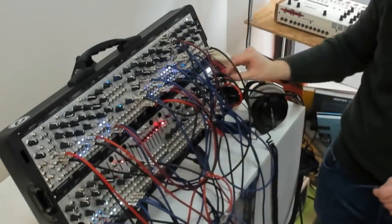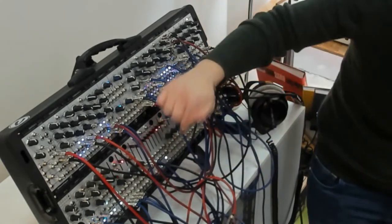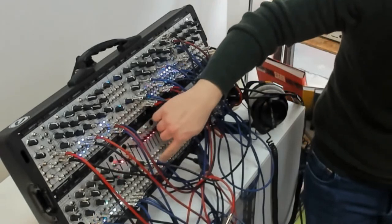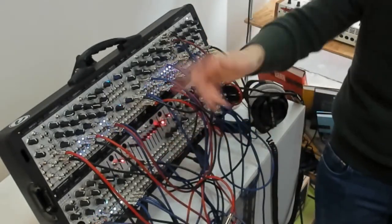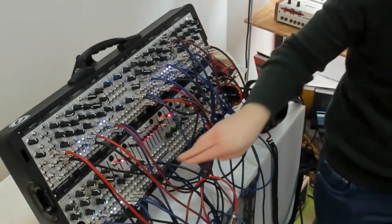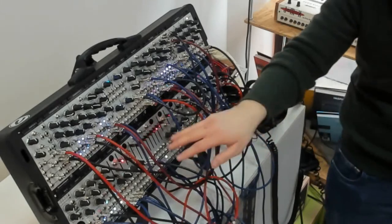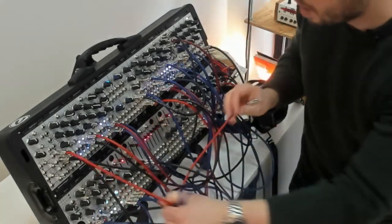So also I should mention that we have been using the scan output so far, and that takes the active stage. And the active stage you can see here on the bottom at the gate outputs. There's always one active stage, that's the one the input is connected to. The scan output takes the analog voltage of the active stage, but you also have a separate analog output for every stage. So all of these voltages are always available at the same time. We can take...